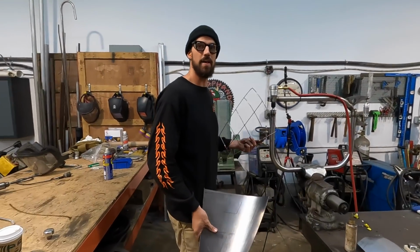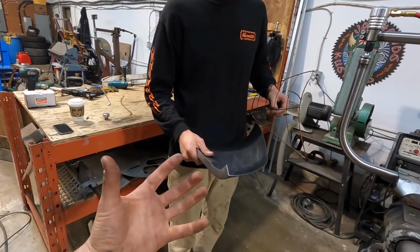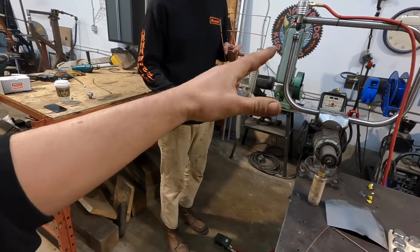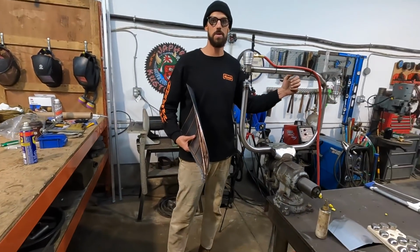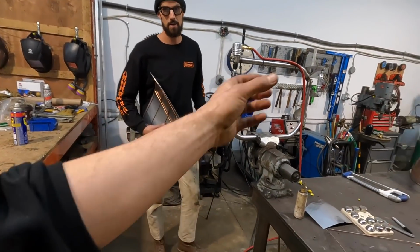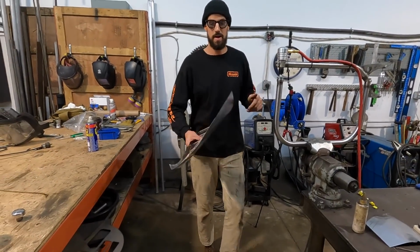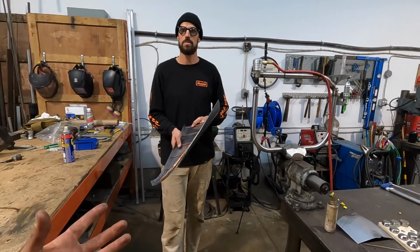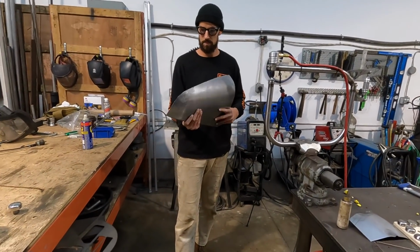Is there any way you do it differently from the way I was doing it, like using the planishing hammer? No, not really. When you're planishing, if you're not using so much pressure that you're stretching, you're not really worried about it because you're just smoothing. You know how you're saying you set this up where they touch and you give it a little bit? So if you were to give it a bit more, that's when it's going to start to stretch? When you give it too much air pressure. Because no matter how much pressure you give it, it's going to get more pressure from the shock of the hammer. And is there a rule of thumb for PSI? I don't really think there is, because it's probably different on all kinds of hammers. For me, I just like to feel it out. If it's doing its job, then you're fine. Yeah, totally.